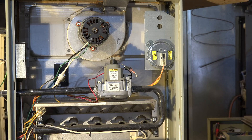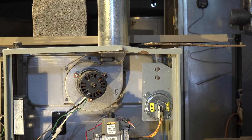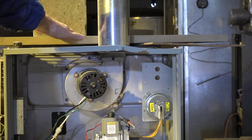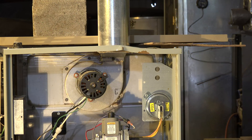What we're going to do here is demonstrate how a gas furnace reacts when there's no airflow — it's going to limit out, which means it's going to shut off its burners. This furnace is just a test mule, temporarily hooked up. You can see I've got a piece of sheet metal placed over the plenum with blocks on it to hold it down, so that's going to reduce the airflow to almost nothing.